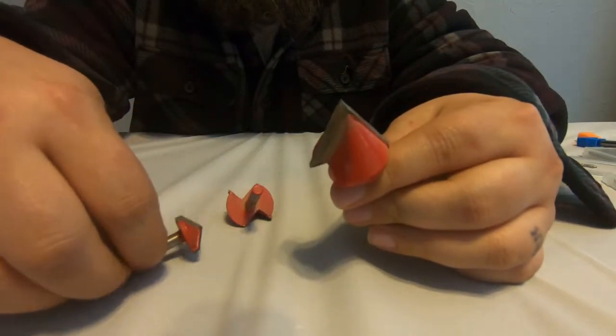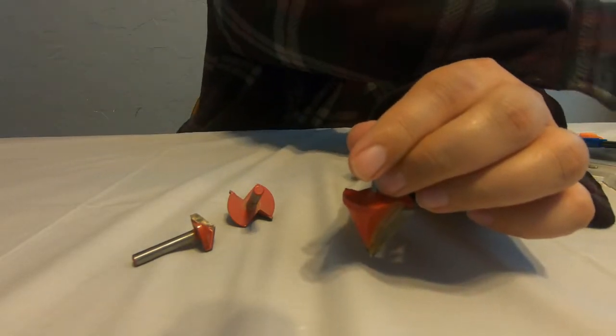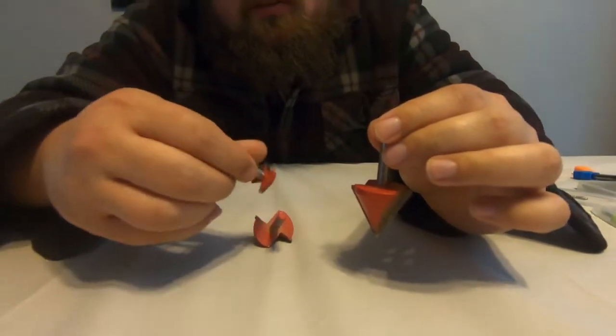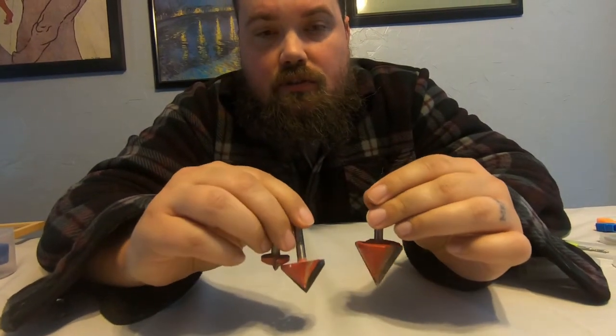Most of the time I can use a 60 degree. If we want a flat bottom, the tool pathing would have a clearing pass that we'd use a flat end mill for, and then just V-bit on the sides. So it all depends on your tool pathing, but these are great options to have to be able to use different degrees.